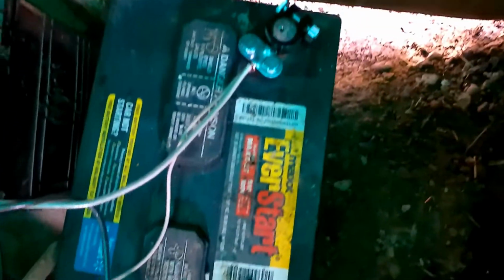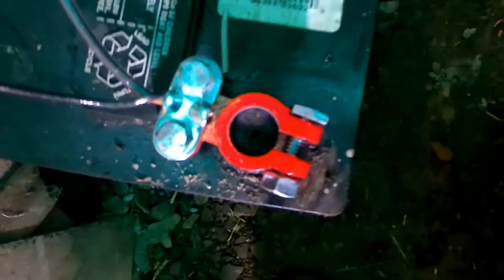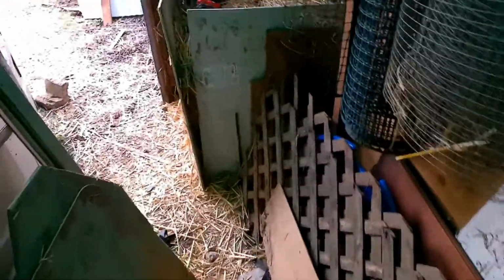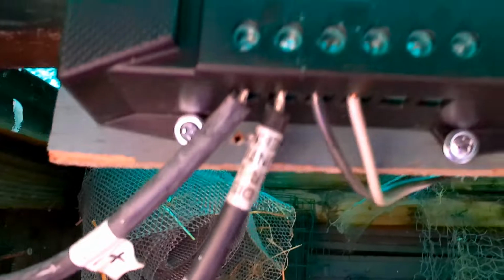From the solar charger, this wire is coming down to the battery. It's running in parallel with the pump that goes outside. I've used 2 terminal clamps here, battery clamps. Put them on nice and tight, very important. And then once the battery end's connected up here, we're connected into the box, of course, and after that then you put your solar panel attachment here.